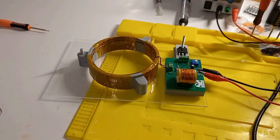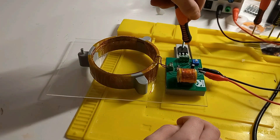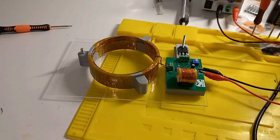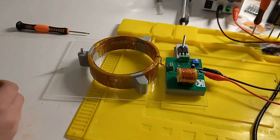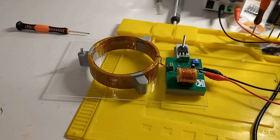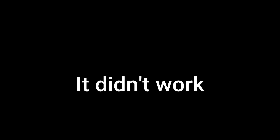It's time for the first test. It feels kind of early, but I guess it's sort of done already. Just gonna start adjusting the bias. Nothing. That's weird. Oh, the current's going up. I'm not sure what's going on. So, the circuit isn't oscillating. I think the coil just doesn't have enough turns and not enough inductance, so it can't properly oscillate. I think I'm just gonna have to double the windings and see if that fixes the problem.